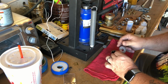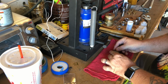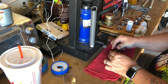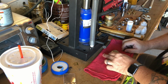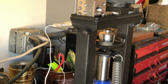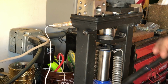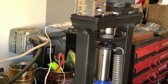Alright, now it's time for the first and most difficult fold of the entire process. Because this is a tough fold, I'll be using a stainless steel starting cone. The stainless steel helps make this push a lot easier, and because it won't be contacting the sides of the coin as I'm doing it, it's not going to obliterate any of the interior designs. After this, however, I'll be sure to use a soft pushing cone for the rest of this.